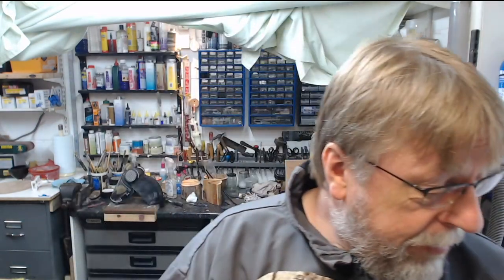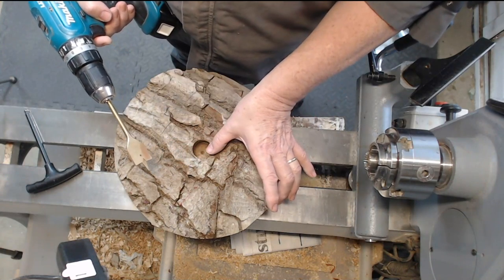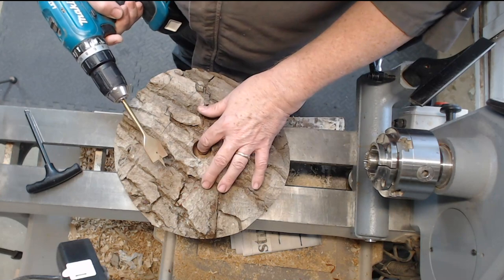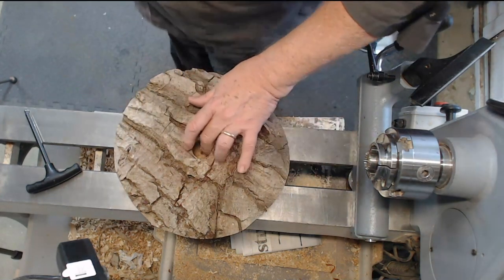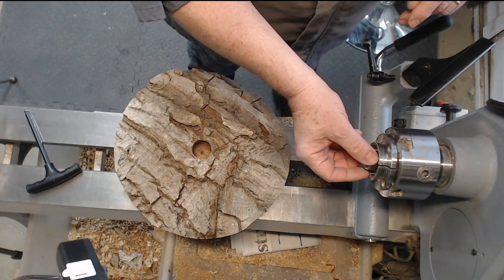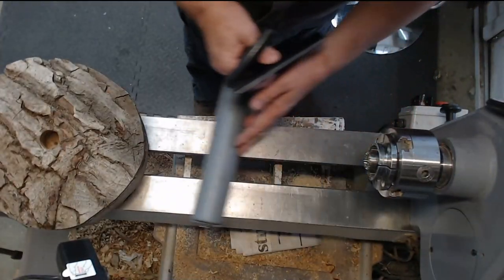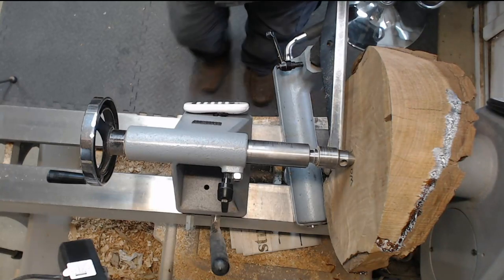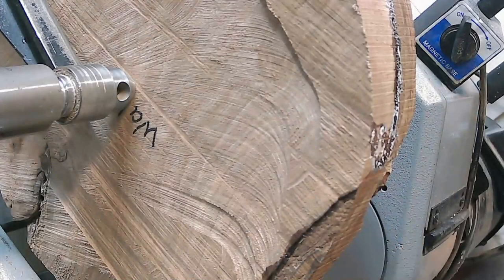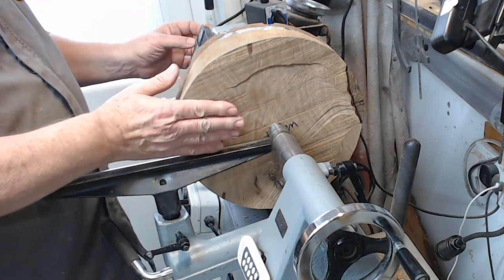All being well, it might fly off, you never know. I was going to just grip the piece with the step drive in the chuck but the wood was not feeling solid enough, so I took it away and used a spade drill to actually make a hole through the bark so that I could then fit it on to the step drive. But then I discovered that having it in the chuck meant there wasn't enough length, so I had to take it off and fit the drive straight into the headstock, and I could then fit the wood nicely and securely on the drive, with a centre and ready to turn the back end of it.